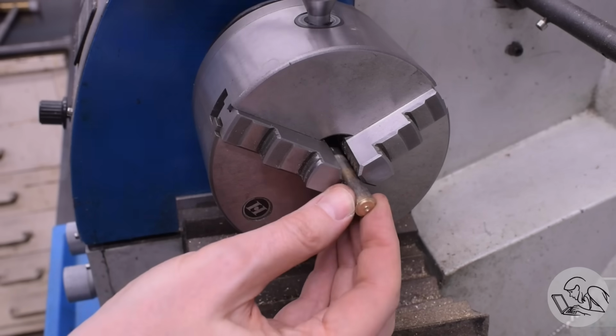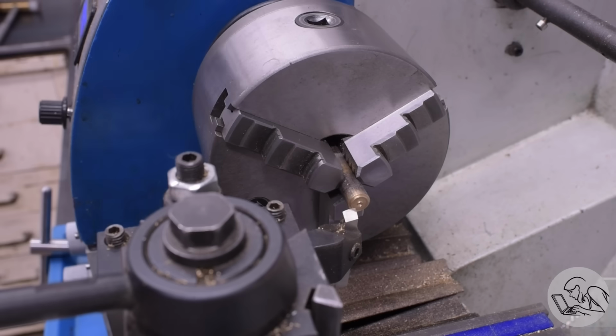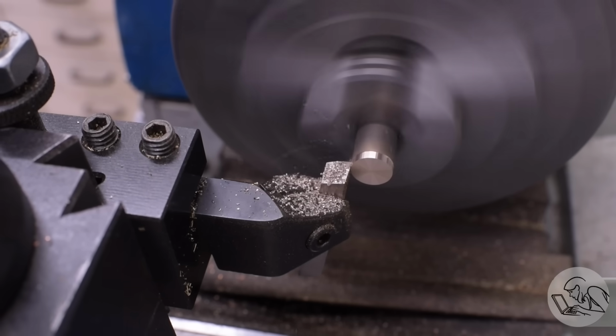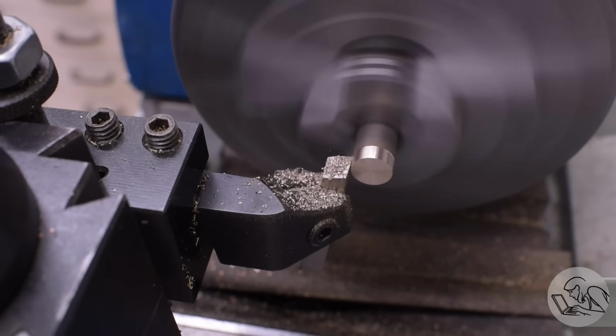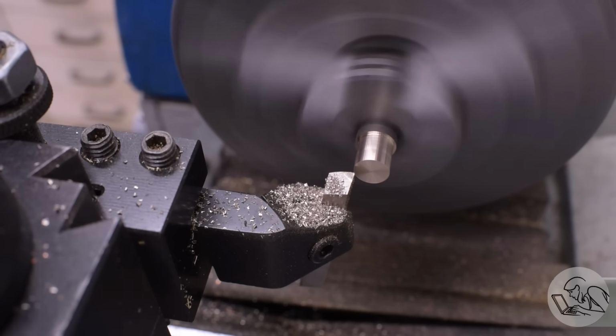Over to the lathe now, I'm going to make some boiler bushings to go in those holes. Boiler bushings are little flanged pieces of bronze that give you more depth in order to put threads into a thin boiler shell, and they also convert the joints of the shell from tension joints into shear joints.